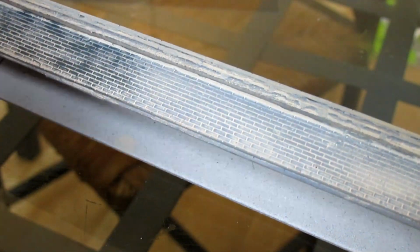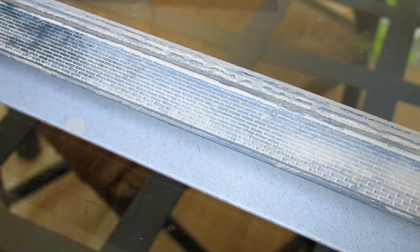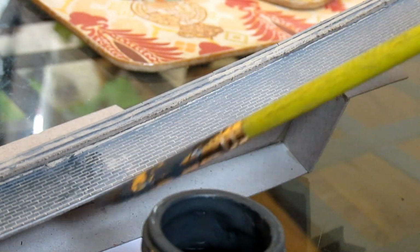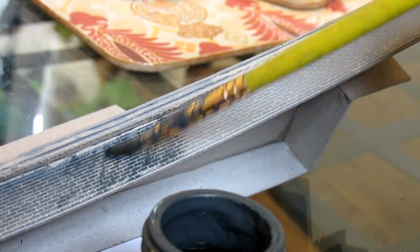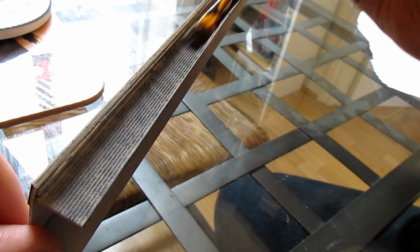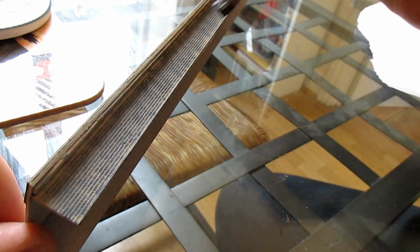And also don't worry if the mortar colour comes through, because again that can look like mortar staining, and this can be quite normal on brickwork that's been standing there for quite some time. After both the slabs and the walls were dry, I did come back through and did a second coat, very lightly, just in areas that looked as if they hadn't received much paint, and I just wanted to make sure that the coverage was there without going over the top of the paint.